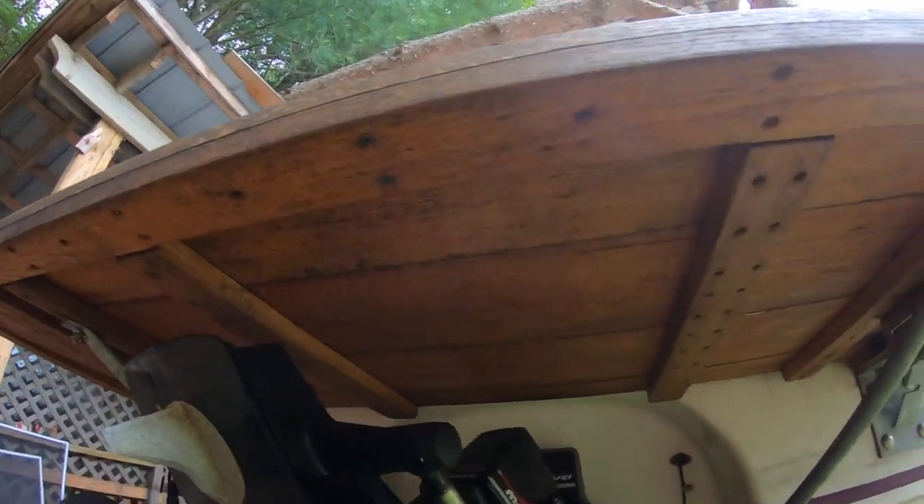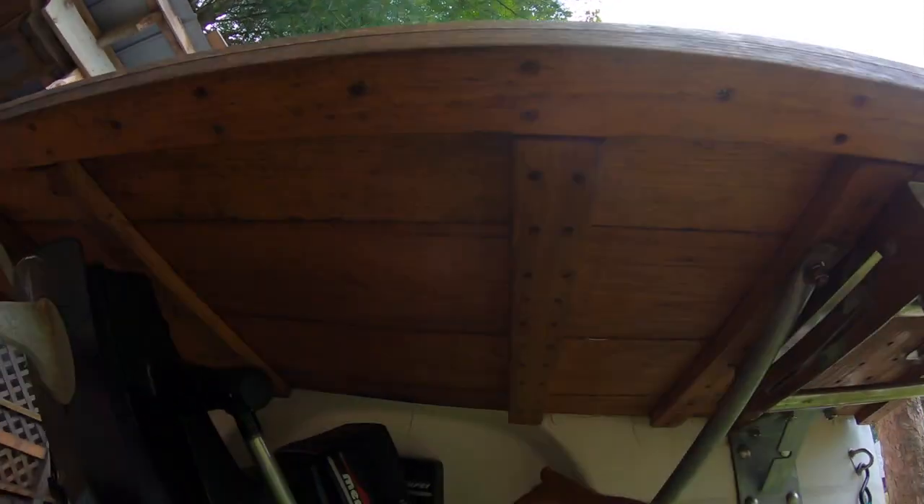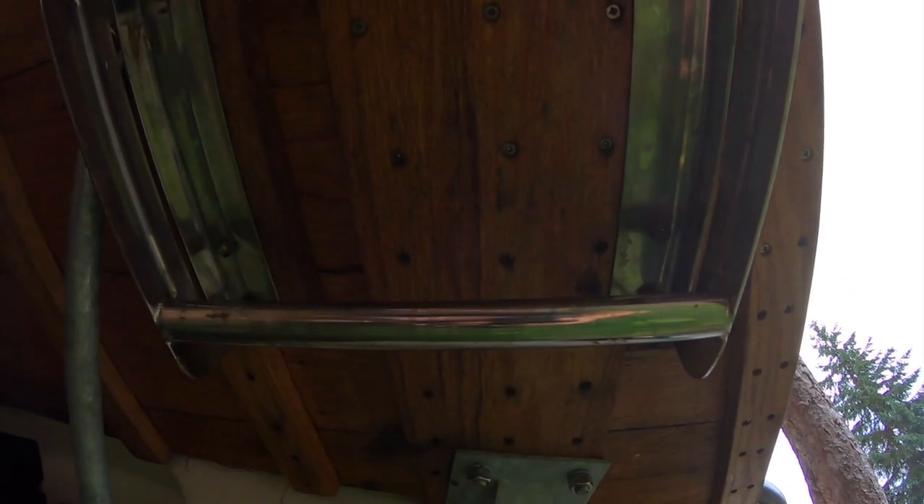Once I got that radius, I had to figure out how to support all the boards on top. I've got a board running around the perimeter, and everything is screwed in to the top boards using stainless screws. From that perimeter piece, I put a few pieces going perpendicular to the boards to hold them in place. Right above each bracket, I put a wider piece also secured with individual stainless screws — and I wasn't cheap on the screws; I put lots of them in.